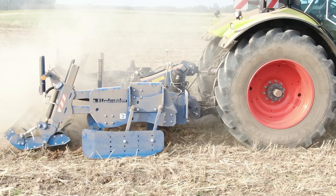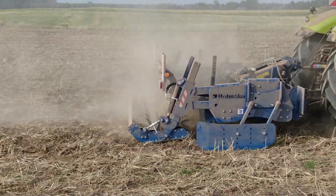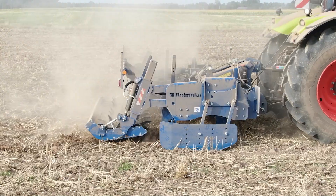The chisel plow U-624 is a device that provides savings by using one tool instead of several others. It is used for breaking and aerating the soil, for deep loosening of the subsoil to improve its structure. Such a procedure can fully eliminate traditional plowing.